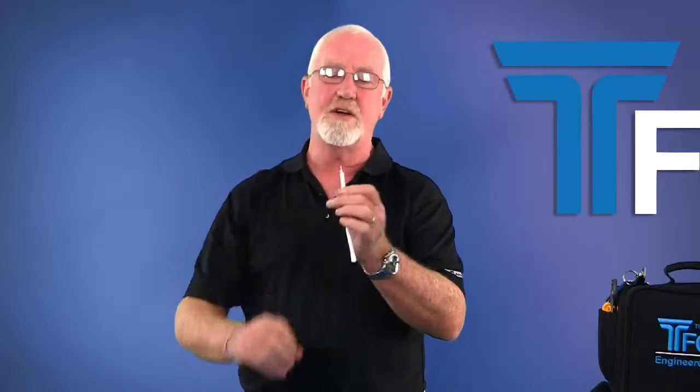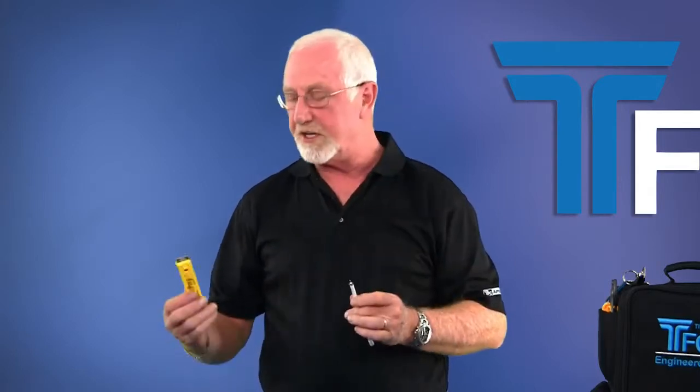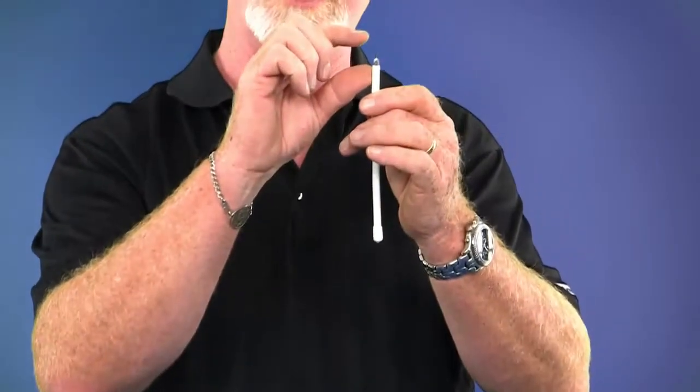When you've pulled this off, inspect it. Make sure that all the braids are cut. An indication that you need new blades is you've left longer pieces of braid in there, which can tend to wrap around the center conductor and short out the connector.